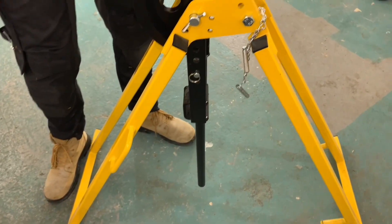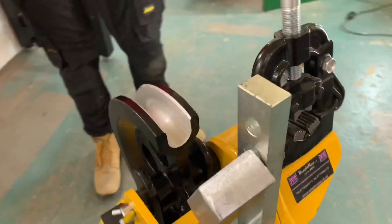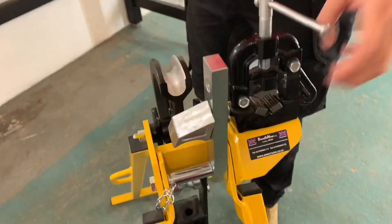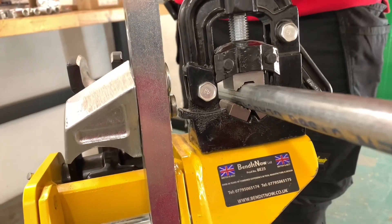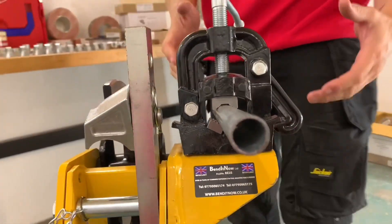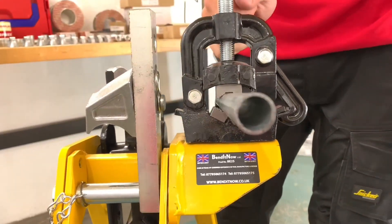As I'm looking at the legs in relation to the vice attached to the conduit bending machine, it seems to be at a bit of an angle. What's the thinking behind that? You'll see why when we insert the conduit. This is also a different vice — this is a round jaw vice. Why is that? Obviously a traditional vice is usually flat, and that could crush or flatten the conduit slightly — we don't want that to happen.